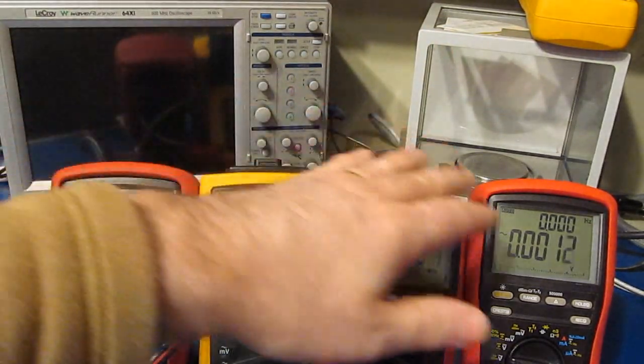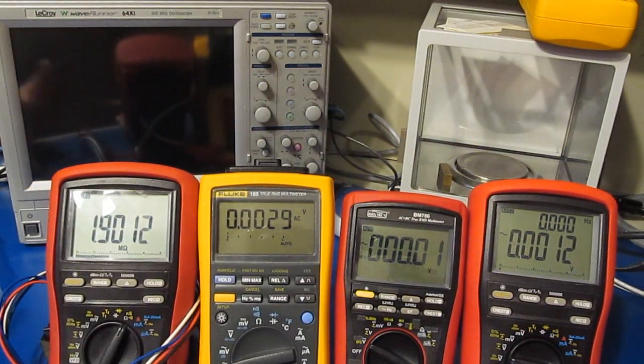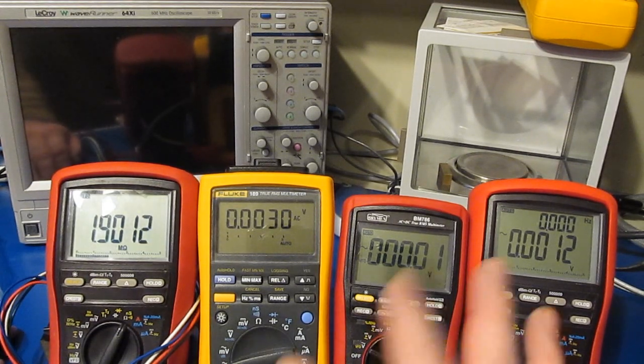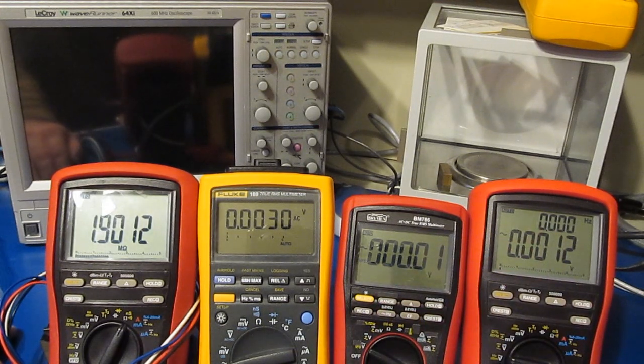So what we're gonna do is we're gonna repeat that test. I have three meters now that are attached in parallel. Again, these are connected up to our amplifier. I'm gonna change things up a little bit differently than what I ran last time. So I'm gonna run the same two voltage levels that I ran previously, but I'm also going to increase the voltage. So there'll be a third level where I take the voltage up beyond 350 volts. I'm also gonna add a few waveforms to the mix. So I'll still run the same waveforms that we ran last time, but there'll be some additional ones included in this library. I'm not gonna be using the oscilloscope this time.